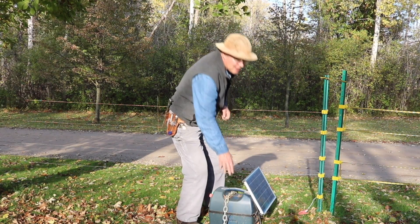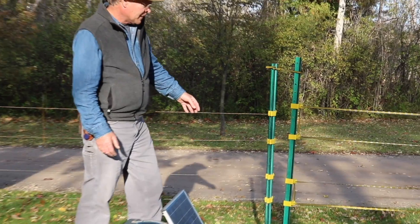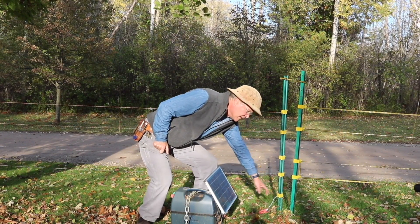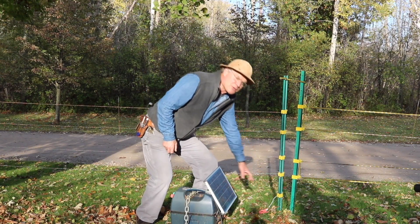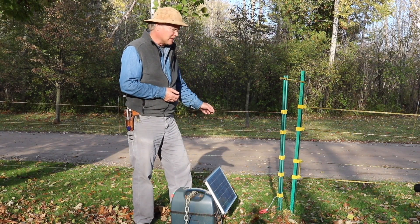This is a very powerful fencing unit. You can get fences designed for everything from squirrels to polar bears — apparently this one will make a polar bear do a back flip, so it kicks out quite a jolt. The strands need to be spaced evenly so there's no way for a bear to climb into the fence. We've excluded the bottom wire here for maintenance purposes to make it easier to cut the grass, but in real use you'd have that bottom strand in place. Vegetation must be trimmed or sprayed to keep it down and prevent grounding out that bottom strand. Some people even put pea gravel along the bottom to stop grass from growing up.